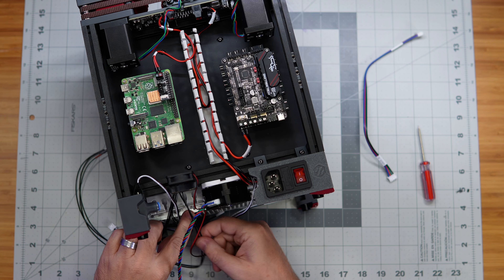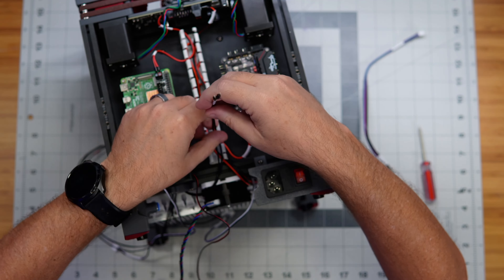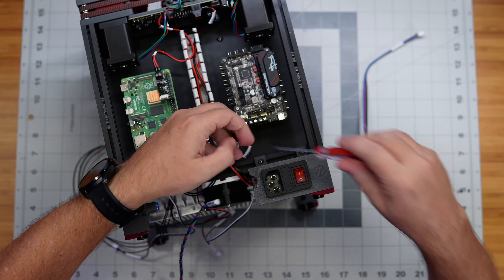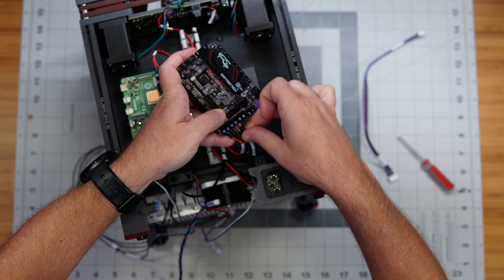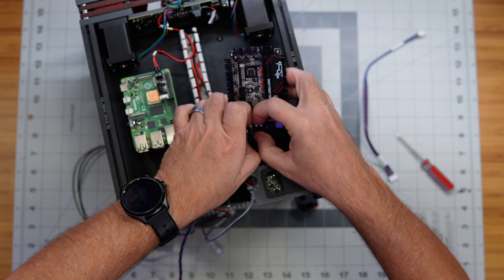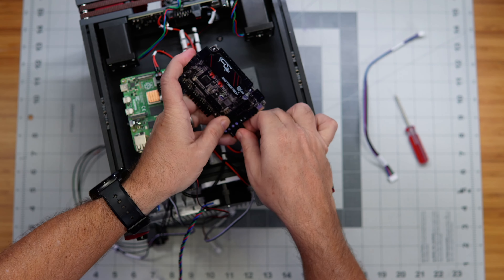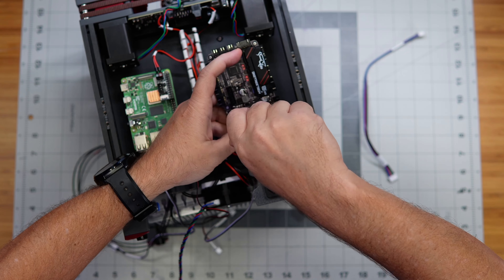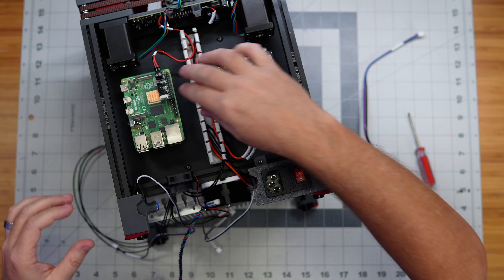There was one bit of power I forgot about in the last step — these two power leads that go up to our bed heater. That's supposed to come out of here, so I'm going to run this real quick kind of up and down through there and go ahead and plug this one in up here as well. I found that in a lot of cases it's easier when plugging things in — especially to this board — to just disconnect it off of its rail, tighten the terminals down, and then snap it back on.